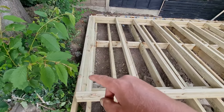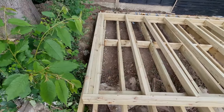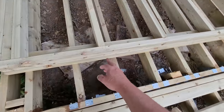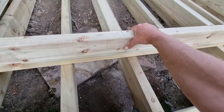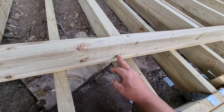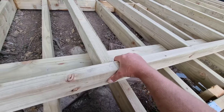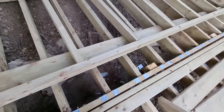Right, normally in a house you'd probably just use offcuts, little pieces in there, but I've got enough to waste a full timber. Plus I don't want any problem if you can see it. So I've just put one nail in at the moment and I've got it sat on this timber. So before I nail it, I'll pull it forward off that, because Sod's Law says if I nail it there, one will come through and I'll nail it to this board. But if I pull it forward off there, then the nail's not going in anything.